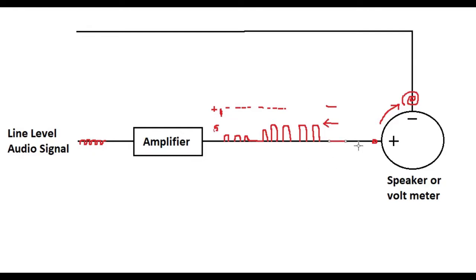So that's all we're going to do - measure the signal, measure the voltage with our Arduino instead of a regular voltmeter, which would be hard to read at these frequencies anyway because it bounces up and down so very quickly. But the Arduino can do it, and in a nutshell that is how we are going to detect syllables. We'll have software that processes this information and decides when we have voltage and when we don't.